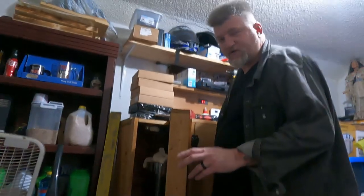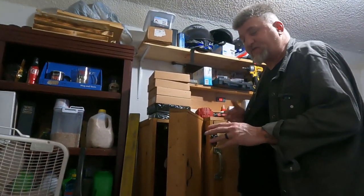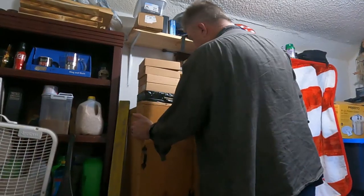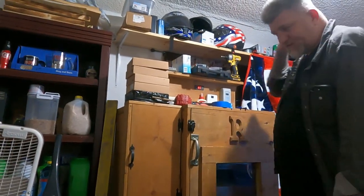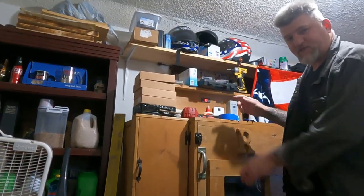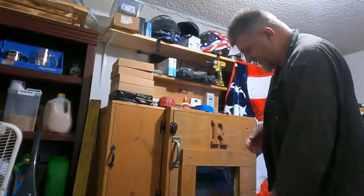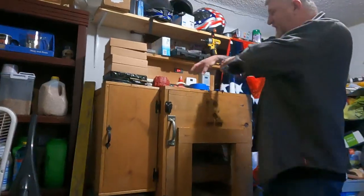I added 2 pans of water down there because yesterday and today are the first days it's been running. And we're just now getting the bugs worked out of it. It has 216 eggs in it right now. So, anyway, what I did is I plumbed that up to a bar inside, drilled holes in it. And when it kicks on, it blows steam inside the cabinet. Well, humidity, I guess, vapors, whatever you want to call it. Moisture. And then there's 2 fans in here.